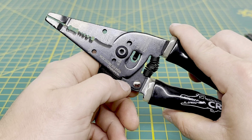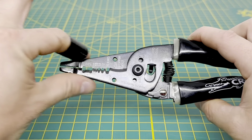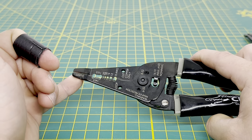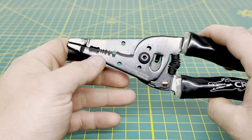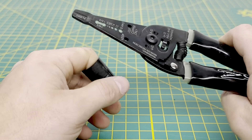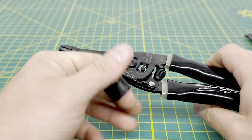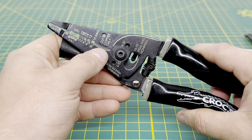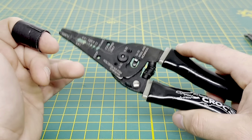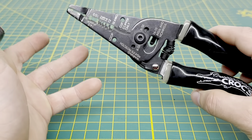These have a lock and are kind of like a standard pair of wire strippers. The one thing that makes them different from the Klein strippers for Romex is these only have one slot, whereas the Klein has one for 14-2 and one for 12-2. You also get two looping holes, a 6-32 and an 8-32 screw cutter for trimming machine screws. The cutter is only meant for copper and soft wire, so cutting harder wire will damage the cutting edge.